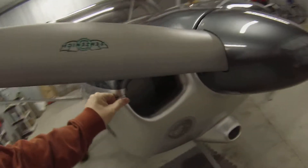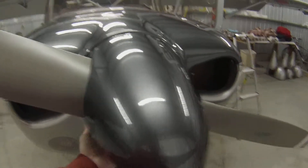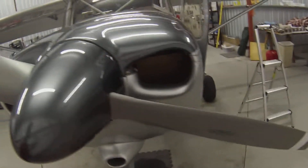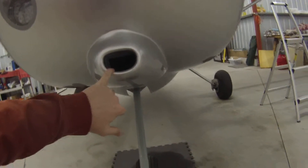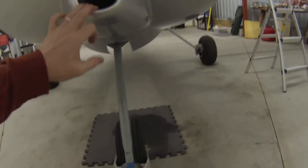Check the condition of the cowling itself, the hinge pins that hold the top half on, and the machine screws that hold the cowling on — those all look good. Check the fasteners on the spinner, run my finger over the edge of the propeller looking for nicks — don't feel anything. Check the tension on the alternator belt, make sure it's good. Take a peek inside the intake, looking at the filter, make sure I don't see any critters that have gone in there. Then give a quick tug on the exhaust, make sure nothing feels loose.